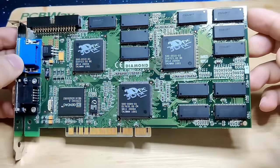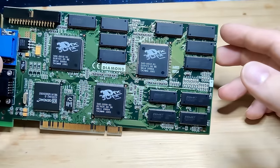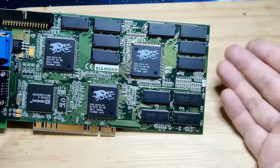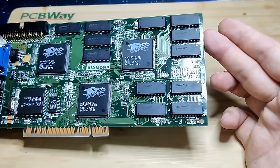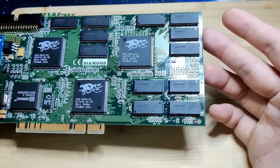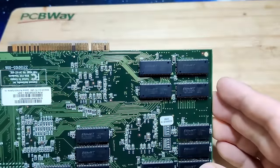And by the way, I tried many things. I followed some of your advice using diode mode, trying each connector of the memory chip, see if there is something different. But everything looks fine. To me, the memory chips really look okay. I don't think there is any problem with the memory chips.